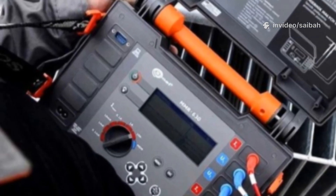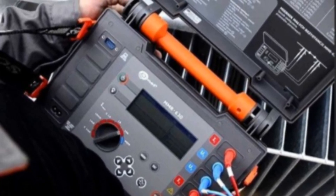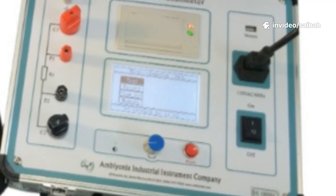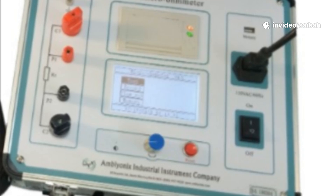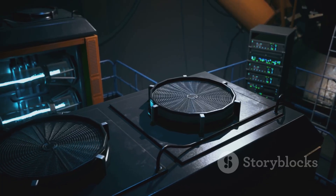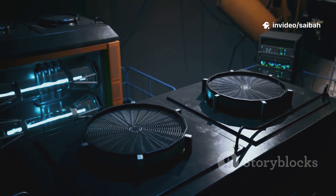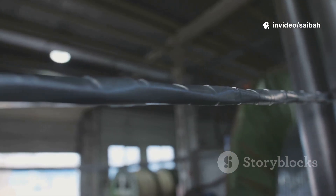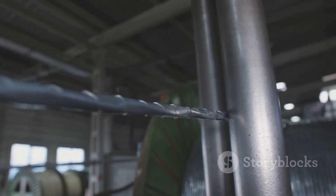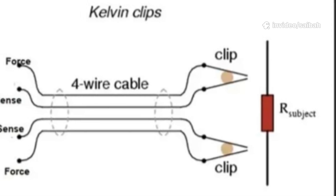What tool do I use? A ductor tester — a specialized ohmmeter built to push high current and read tiny resistances. You'll see micro-ohmmeters, milli-ohmmeters, mega-ohmmeters. But for contacts, the micro-ohmmeter is the go-to. Classic ohmmeters come in two flavors: series and shunt. In a series type, the unknown resistor sits in series with the meter and battery — open leads read infinity. In a shunt type, it's in parallel and low resistance pulls the pointer toward zero. Useful to know, but for real-world contact checks, I lean on the micro-ohmmeter and a Kelvin connection.